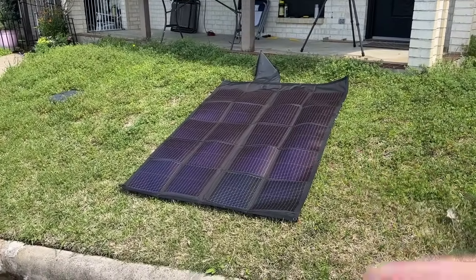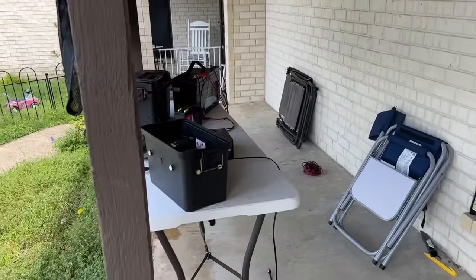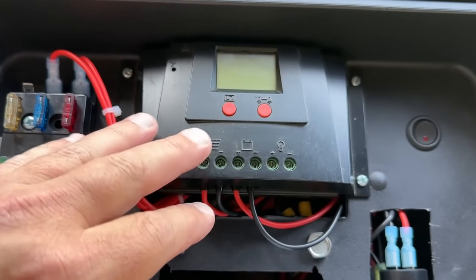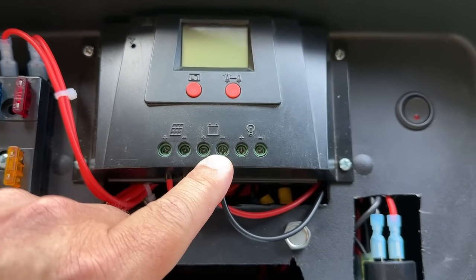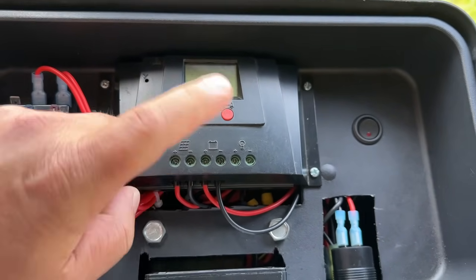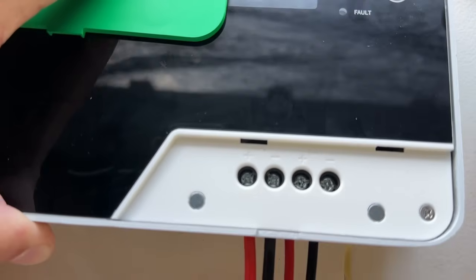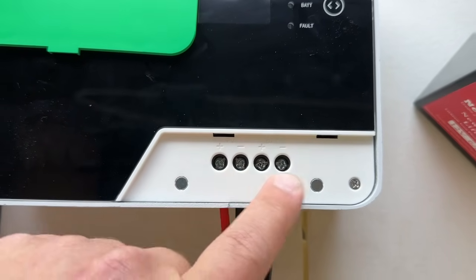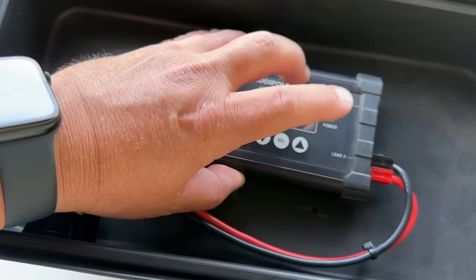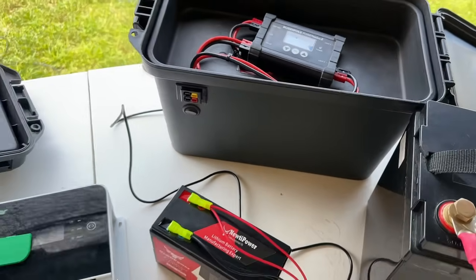Here we are out front. I've got a 100-watt panel from PowerFilm, and I've got a number of different batteries and charge controllers here set up so we can show you a couple different ways. Charge controllers are going to come in a few different ways. Some of them are going to have a solar panel input, a battery output, and a load. I personally don't like to pull from the load on the charge controller — I like to pull it directly from the battery. Here's another charge controller where you can see it says PV for photovoltaic and there's the battery, but there isn't even a load on this one.